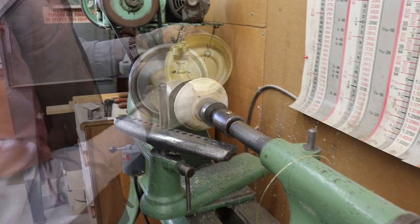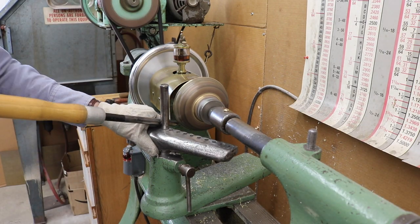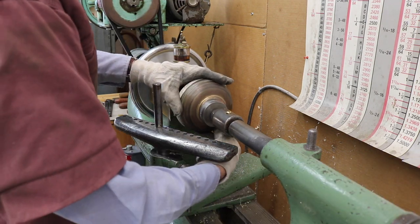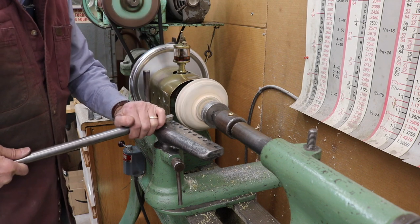This piece has work hardened and requires annealing by heating to a dull red in order to spin it down tightly to the chuck and spin the rounded edge. The discoloration of that shell is a result of that annealing process.